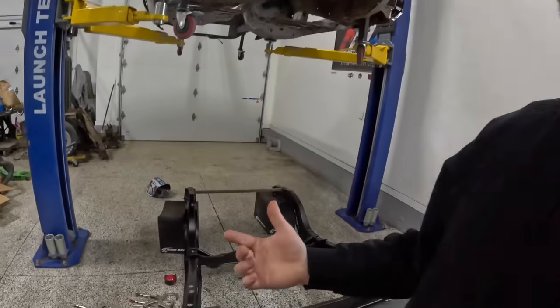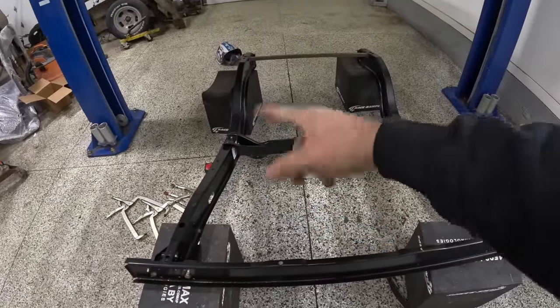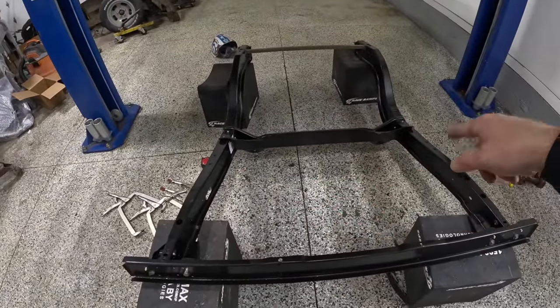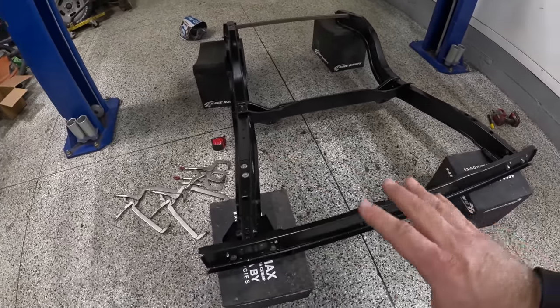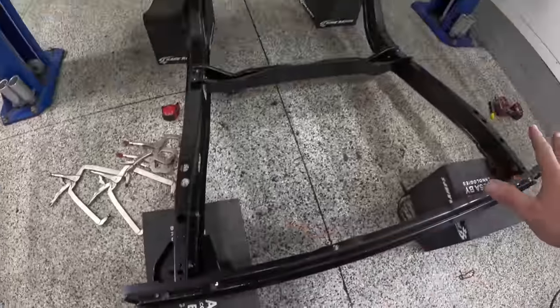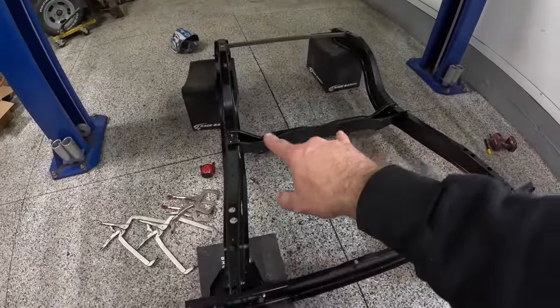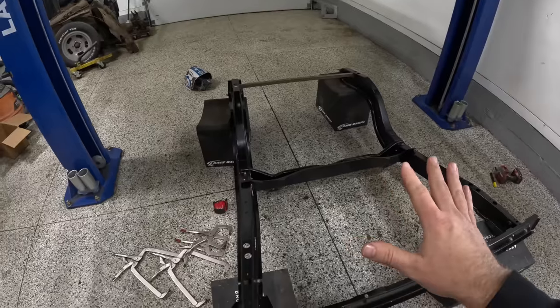You know, these cars were put together 50 years ago. They didn't have quite the precision that we have today with assembling cars. And no, I did not match the half inch off. It's exactly square, and my OCD kind of kicked in with that. But once I got it all measured out and where I wanted it, again, making sure that the outsides of the frame rails are exactly the same, making sure that the distance between the frame rails up towards the front is exactly where it needs to be.